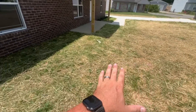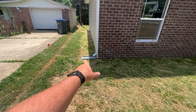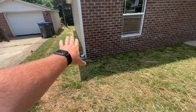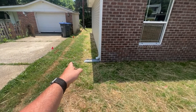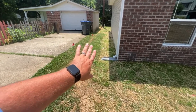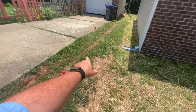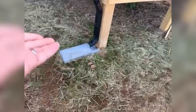This particular house is brand new, and the grading is all back towards the house, which is going to settle. The downspout here is going to make that worse — all the water is going to come off and go back towards the house. You can't hardly tell in this video, but it goes uphill to that driveway. There really should be a low spot between the two where the water comes out and goes left, or put an extension on it to get the water to go to the back of the house. You've got to get that water out and away.